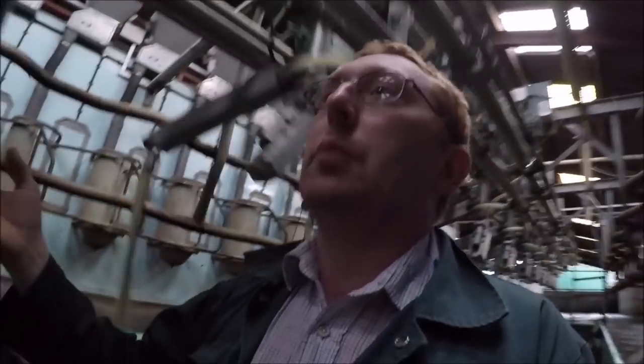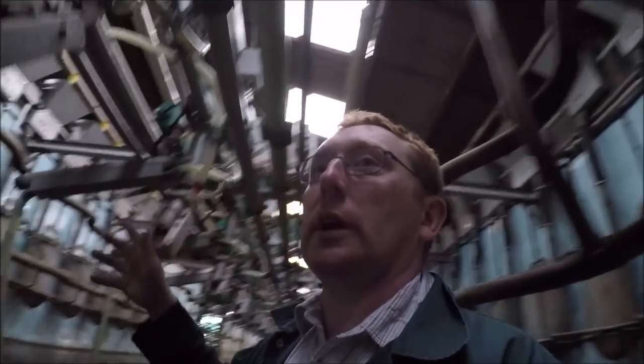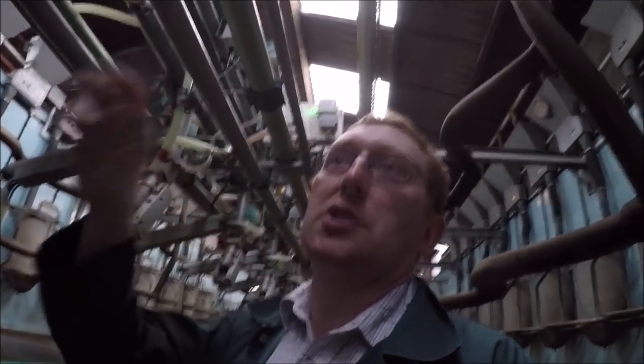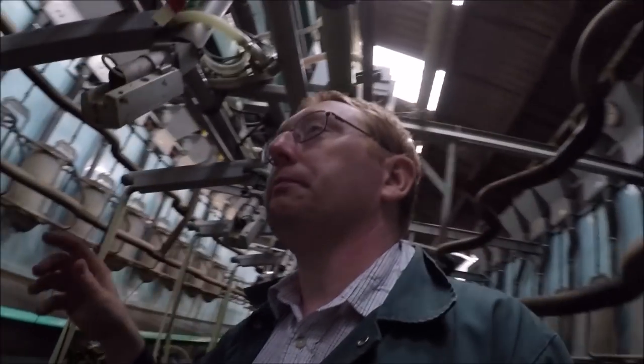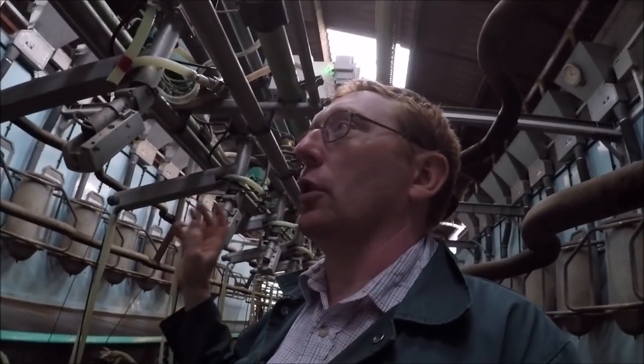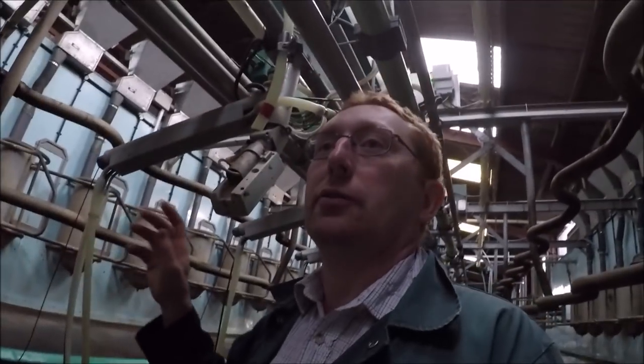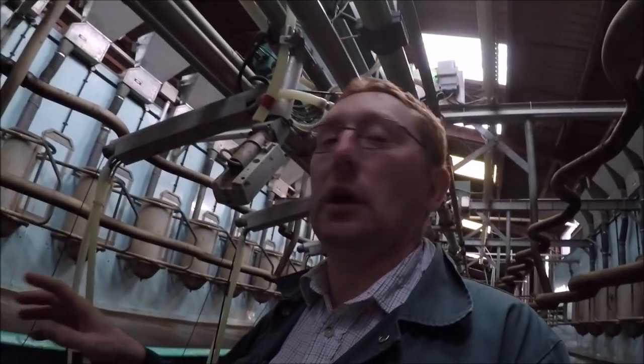When it gets really cold, towards about -10, in the milk line there is a non-return valve, and at about -10 it will catch that valve, but it's all stainless steel, so a jug of hot water on it and it's going in no time at all. So just a few minutes of preparation before a frost gets rid of any risk. I've learned what to do, and it's far simpler to do a bit of prevention rather than cure.